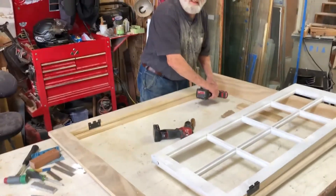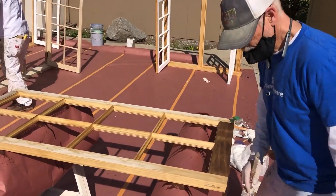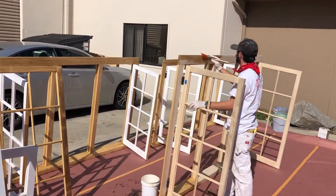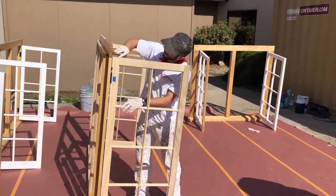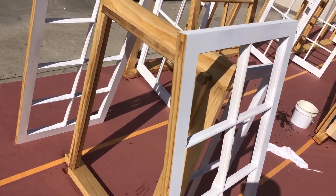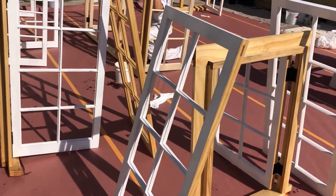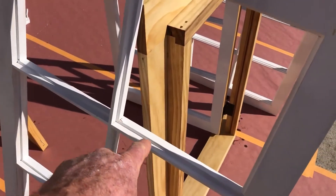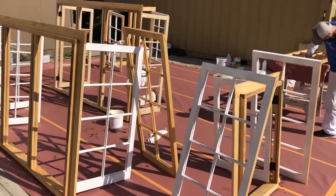We're pre-treating the sashes with an epoxy to keep these windows from rotting over the long haul. We're right down by the beach, so it's important that everything be sealed super well — not just with primer but with this clear penetrating epoxy and then primer. Here are some windows we did last week; they have to trim them a bit for fitting into the frames. This one will go into this frame, so we hit it again with some epoxy and prime it again on that edge. We're doing all this before they put the glass in the sash itself, so all these hidden surfaces behind the putty will be completely sealed up. Our goal is to give these folks windows that when I'm dead in the ground, they're still going to look sharp.